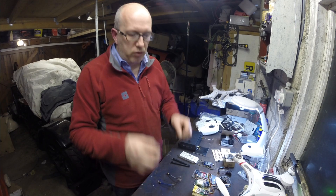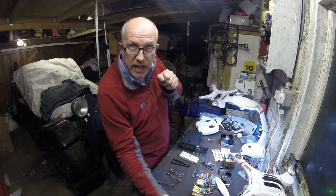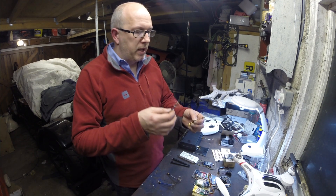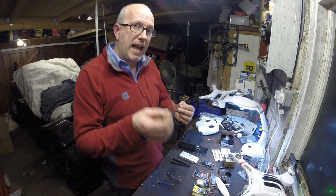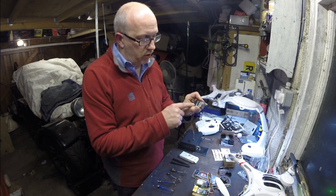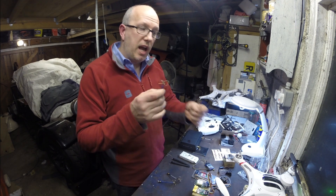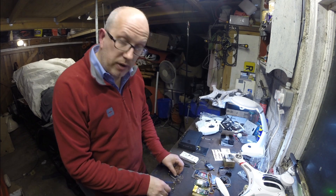The reality is you get a bit of crossover. When you've got something rotating like this and it hits the ground and reflects, it turns the other way — so you're still going to see plenty between the two. But crucially, if you have a left hand antenna next to a right hand antenna in the same frequency range, you get an awful lot less crosstalk. There are guys on the web who've shown that you can have adjacent channels with opposing polarization and you don't get the crosstalk.